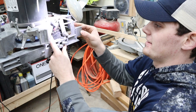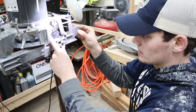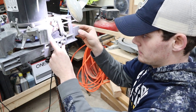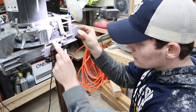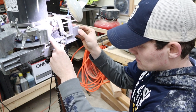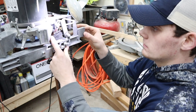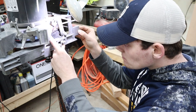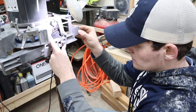I've actually ordered some factory chains — I'm going to do a comparison with round grind factory, work grind, and race grind. We're going to compile a lot of data in some upcoming videos. I just wanted to let you guys see exactly what the grinder looks like and the process. You can see how the theory of operation is completely different against everything you would consider standard practice with a round grind.